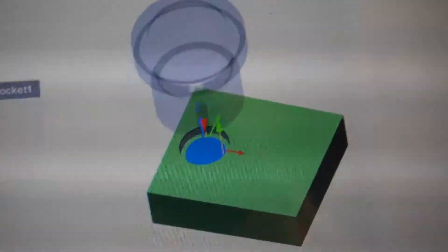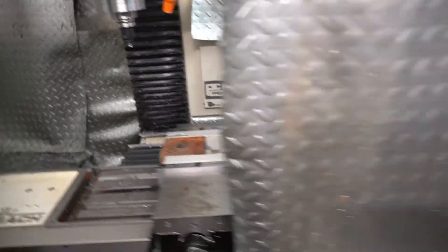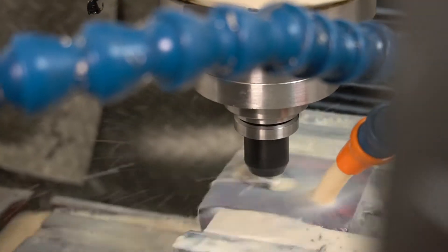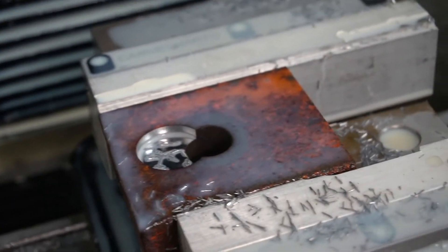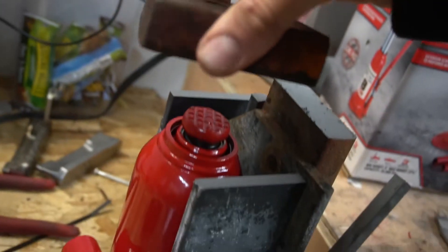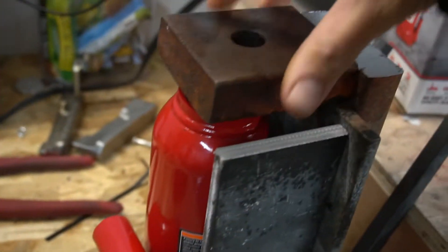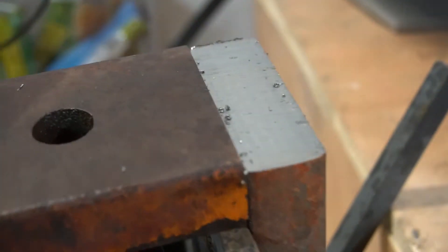We've got a little pocket program modeled up. We're just using a quarter-inch end mill — pretty quick and easy job. I'm going to drop it in 20 thou. It's kind of cool with that old rusty metal and the new metal that just got machined. We've got our hole up in here, and when we set it over the bottle jack you can see that it cannot come forward off the bottle jack — it's going to pull it. The z-bar hooks up and the depth is such that it fits just about perfect.